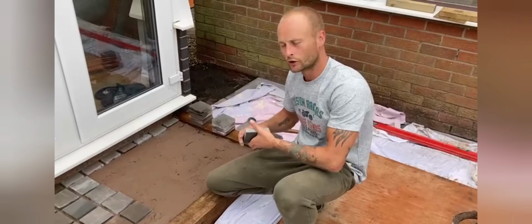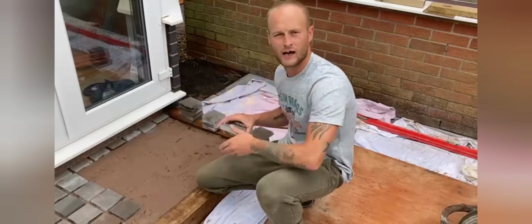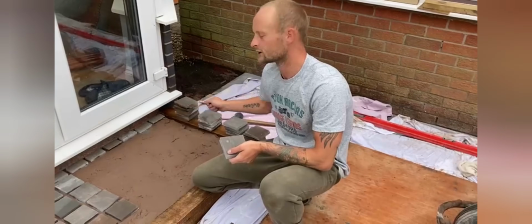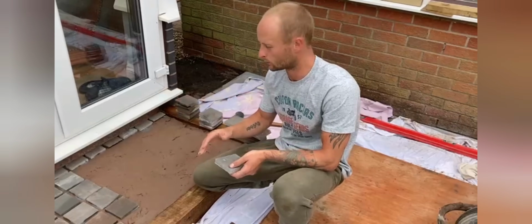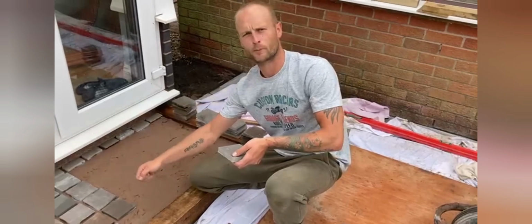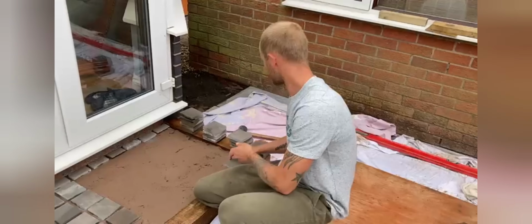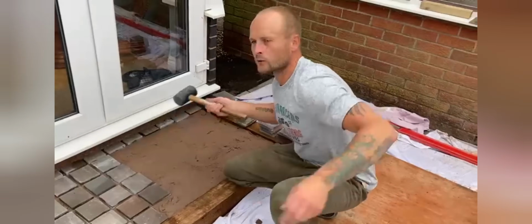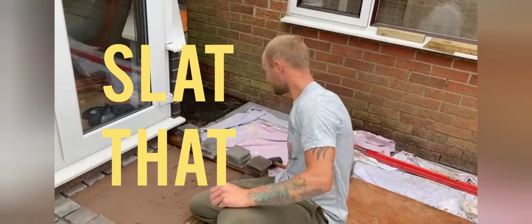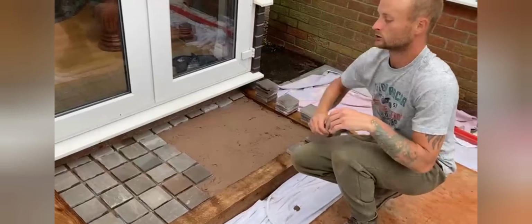I'm just going to get a board and I'm going to place the board over the top of it, same size. I'm just going to give it a nice little tap all over, because it'll be nice straight flat board, nicely bump bump bump. So it's pointless doing that now with these. No point, just place them in till you can see the SBR squeezing out.